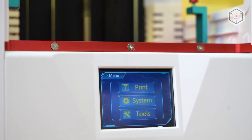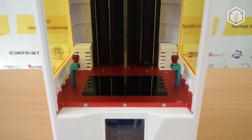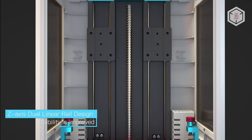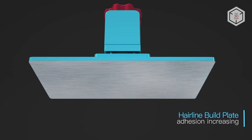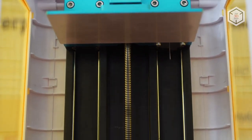The developers equipped it with two linear rails for the z-axis. This increases the accuracy and stability of printing, significantly reduces the likelihood of wobbling — an issue evident in the original Photon. The platform is built of anodized aluminum. Such a surface improves the adhesion, which makes the workpiece more steady during the printing process.